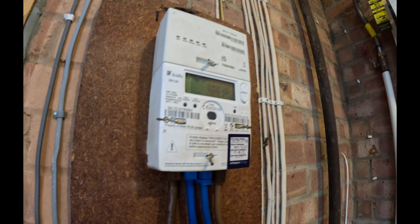I've just had a call from a customer saying they've got a burning smell coming from their consumer unit when their car is on charge, so we're off to look at that. I've just arrived at the property — the customer isn't in yet but Southern and Scottish Energy are here because apparently the cutout has melted. I've checked my installation and it's absolutely fine, but the problem is they recently had their meter changed and as you can see on that live conductor, it's melted away. The DNO are here and they are going to get that cutout changed, and the meter will also have to be replaced as there are signs of burning on that terminal.